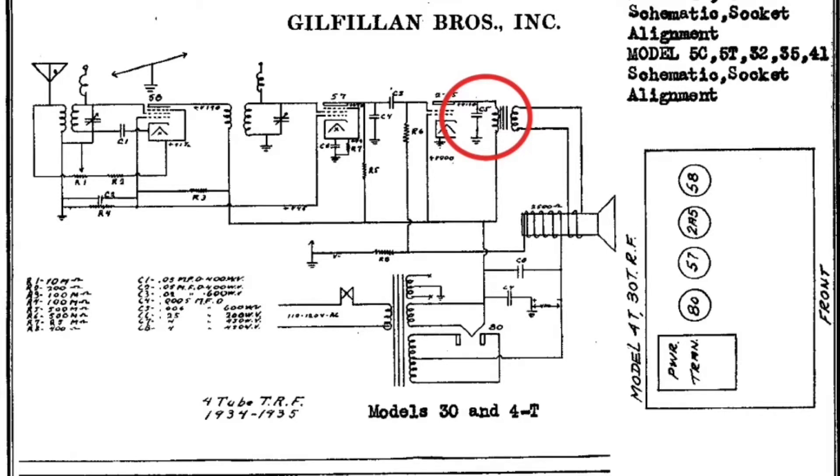I want to show you guys some examples. We'll look at the oscilloscope, but first let me show you some charts I've created. I did some measurements on the loudspeaker using my audio signal generator, starting at 100 hertz all the way up through 5,000 hertz, so you'll be able to see the frequency response of the loudspeaker itself — with the .006 capacitor as well as placing a .01 in parallel with that. I'll probably end up going back with a .01, which should put my frequency response more in the middle of what's depicted in these charts.